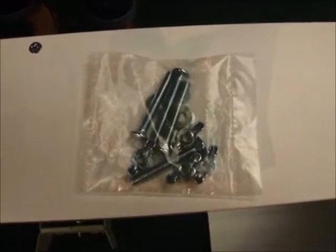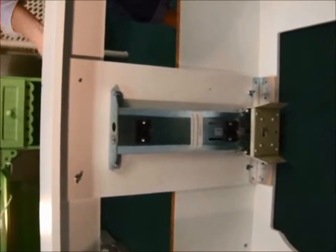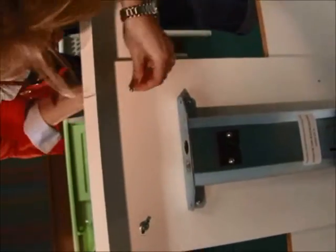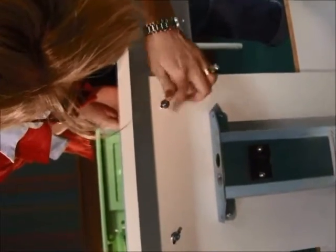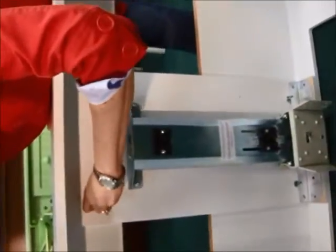Now locate your package containing your carriage bolts, washers, and wing nuts so that you can install the airlift upside down. It is going to be attached with the 4 carriage bolts that you will push through from the back to front. Seat the bolt by tapping it with a hammer and secure with a washer and wing nut. Make sure all 4 washers and wing nuts are tight.